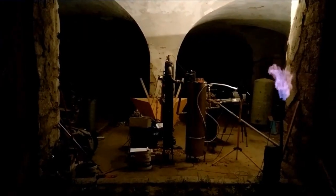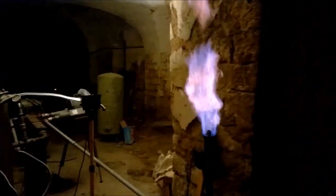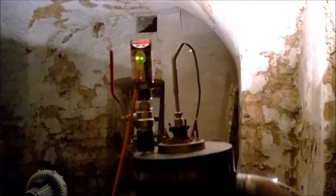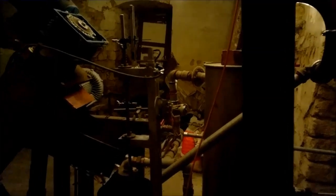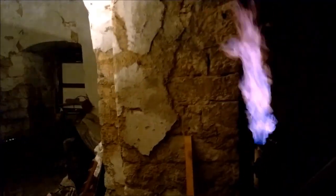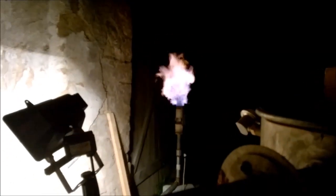I am now exactly three hours into firing. Let's have a look at the flare. Nice flare. I have always had an under-pressure between 0 and 20. Three hours without any problems. This is the first duration test of the grateless gasifier version two. After three hours of steady burning, we reached maximum. We have a nice clean flare.